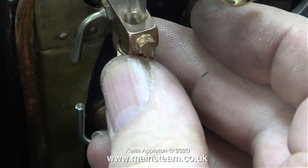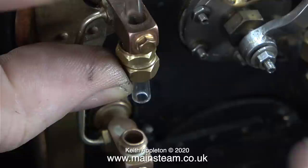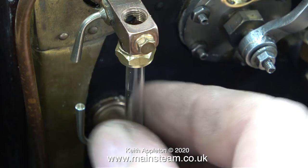When you fit the glass into the fittings, you have to do it in sequence. Push the glass through the top fitting, fit the o-ring, and then the nut. For the bottom fitting, you fit the nut first, followed by the o-ring. A quick word of warning: it's a good idea to rub the edges of the glass on a piece of wet-or-dry sandpaper to remove the sharp edge. If you don't do this, two things are likely to happen — you may cut the o-ring with the sharp edge of the glass, and you may cut yourself.